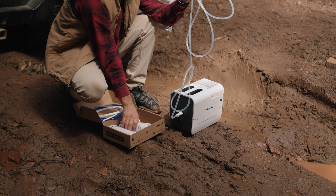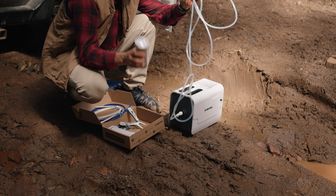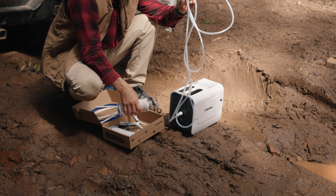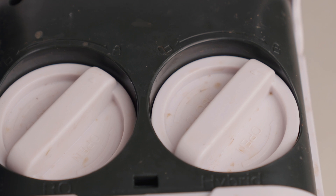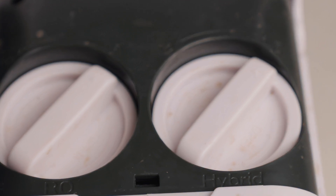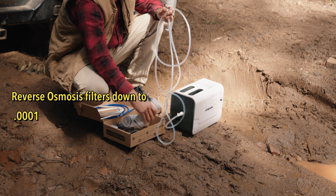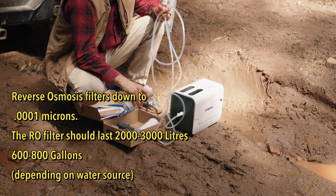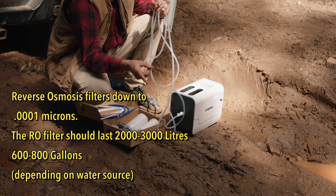Because I haven't put the new filters in yet — there are two filters in the reverse osmosis and there's a hybrid filter. The hybrid filter is the primary filter and the reverse osmosis is the secondary filter that does all the final purification. The first hybrid filter takes most of the coarser stuff out, and then the reverse osmosis — RO — takes all the finer stuff out, including nasty parasites and whatever else you can find in these lovely water holes.